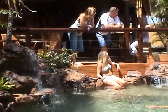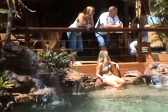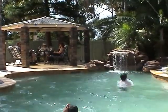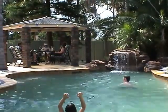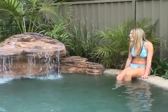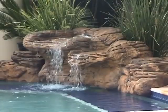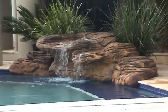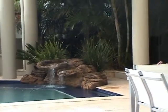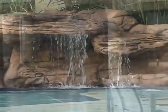Universal Rocks has proven to be durable since 1997 when correct chlorine and chemical levels are maintained on pools. When and if higher levels are needed, simply lower the water level below the rock overhang and do not run the waterfall until levels have returned to normal. We highly recommend that you do not climb or jump off Universal Rocks into your pool due to safety concerns as well.